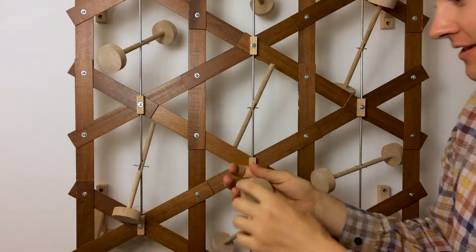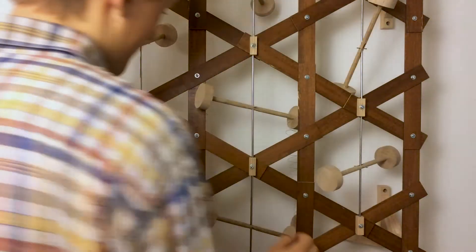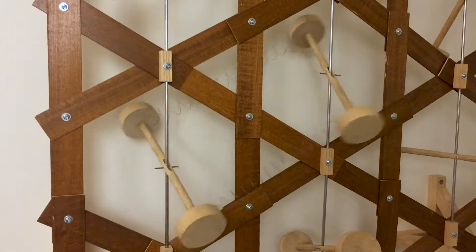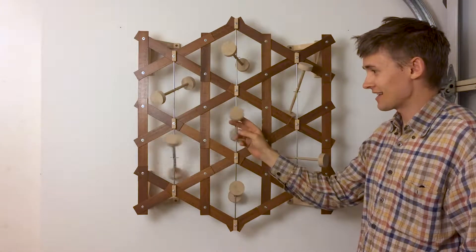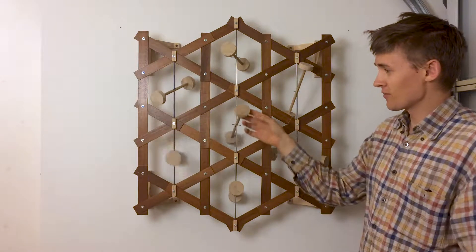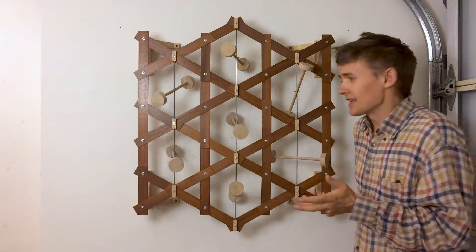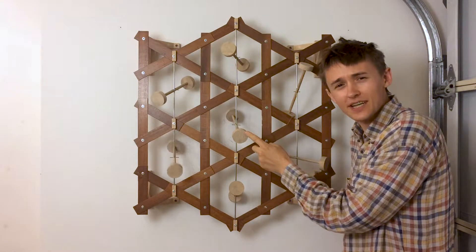Insert one on the front and the other on the back. So we've got a pair of rods and a pair of springs. Oh yeah! Look at that! So I think I've got something here. The action of the pivoting is working beautifully, there's a nice low level of friction, and it's also clear that each of these rods wants to stay parallel. So if I move one up, the other wants to go up; if I move it down, the other wants to go down with it. So they sort of follow each other around. This is something I didn't totally foresee — I was imagining only influence along the direction of the spring.